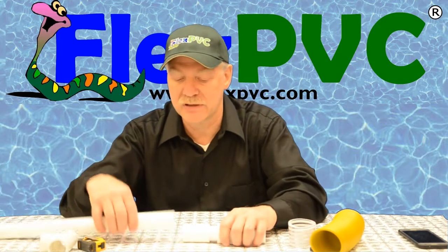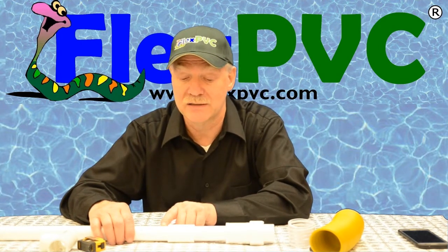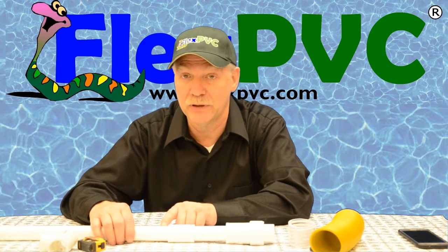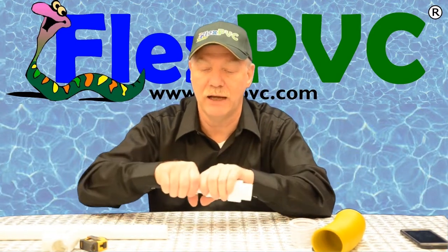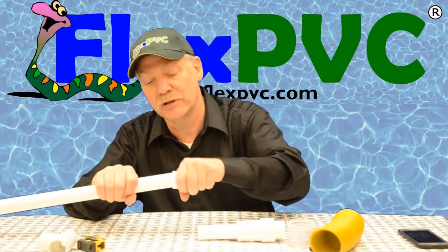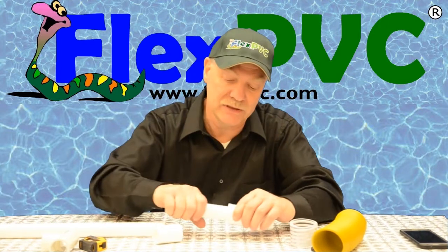So put a bevel on this end. Then prime this, glue this, prime this, glue this. When you push these two together — remember, this one isn't moving, it's in the ground or mounted to a wall — this will pull out. As you're pulling this out, it's going to go right over your pipe here. It takes a fair bit of strength. You have to have good grip strength and arm strength, because when you push this in there's a little detent that holds it in place. So when you first pull it out, you have to pull kind of hard. But once you get it moving, it's not too bad, though now you're gluing into this and there's friction. These are interference fits, so it starts easy and gets tight. You're pushing one way, pulling the other — it takes some strength.